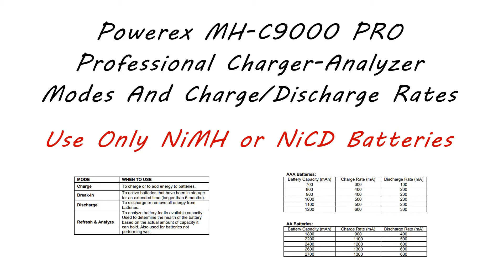The device can only be used with NiMH or NiCD batteries — if you have any other type of rechargeable batteries such as lithium-ion, don't use them in this charger. The device has four modes. The first mode is charge mode, which should only be used on batteries that are known to be good; when it finishes it will tell you the accumulated energy put into the battery, but not the available capacity. Discharge mode will completely discharge the battery and tell you the accumulated energy removed, not the available capacity — I'm not quite sure what that mode is for personally.